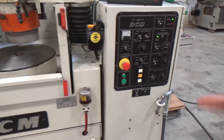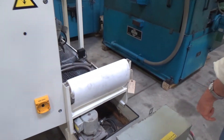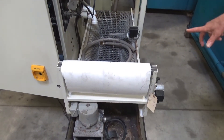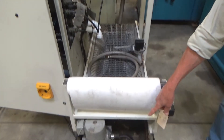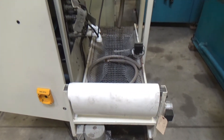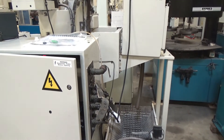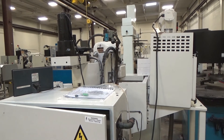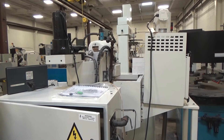Coming around, I've got my transformer on the floor here, converting my voltage to 230 for the machine. It's running an external filter system — paper filtration — and a pump down below, which is not connected, nor is the paper feed. Panning up, you've got the blower unit and mist collector. I can turn that on while you're standing there — that guy there.